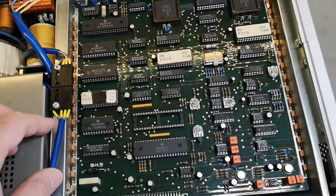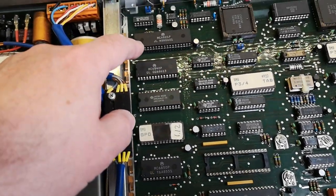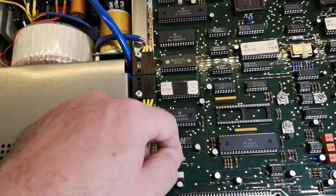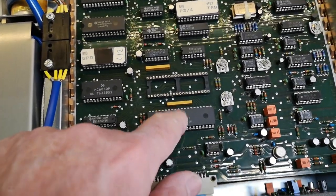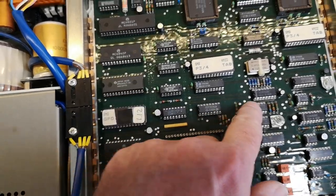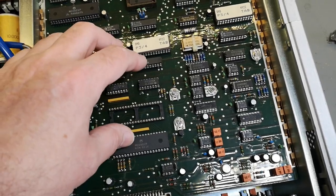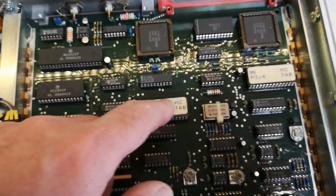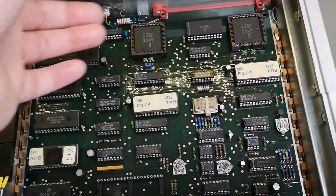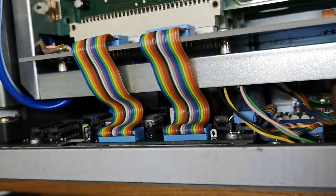What I see is three EPROMs, meaning three different software instances. I don't see a lot of microcontrollers — there's a 6821, a 6840, EPROM, RAM, some I/O and timer stuff, and a 6802. There are also ADC and DAC converters here. Two processors with two different types of software — that's because it can encode and decode at the same time, which is why you need two microcontrollers. On the display board there's also an EPROM.